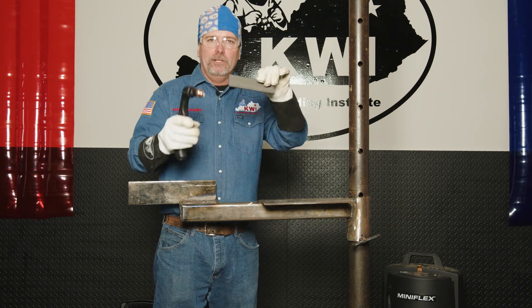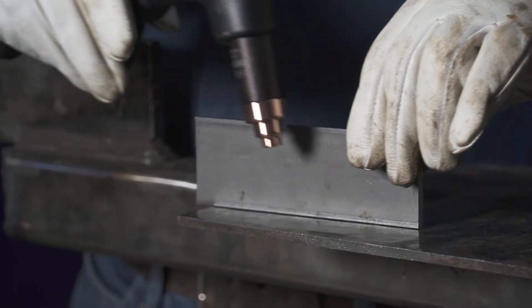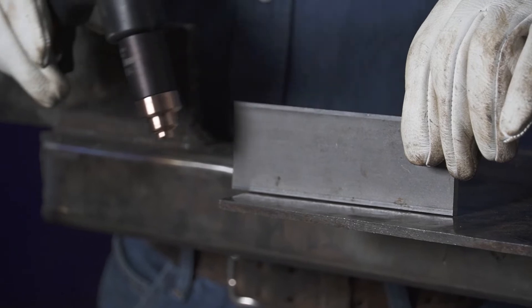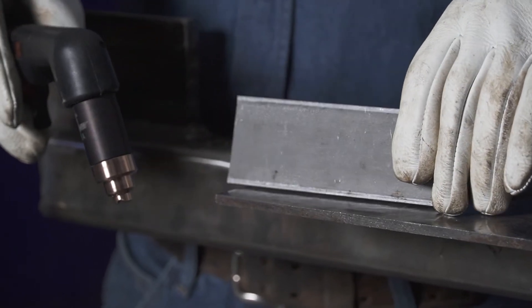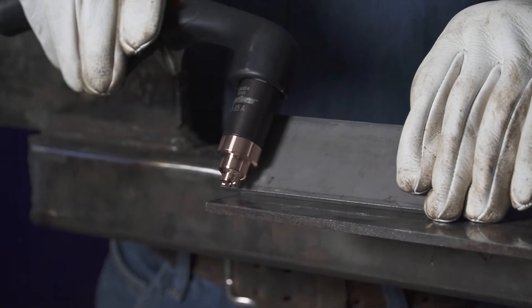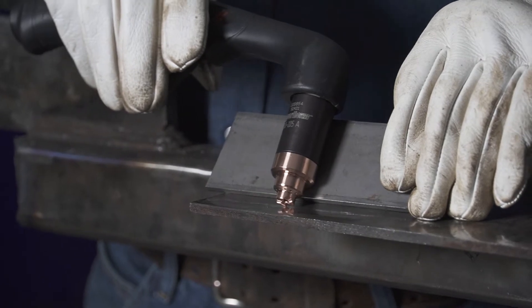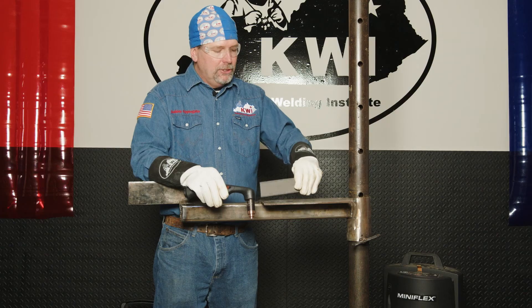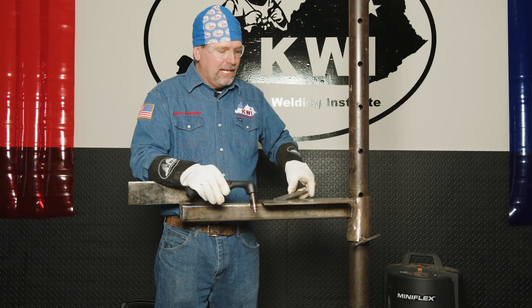You can be really fine with your cuts and do a really good quality job, especially if you were to use a straight edge and drag your drag shield right along to make that perfectly straight cut. Or if you were to angle your straight edge, then you can get whatever bevel that you would be required per the manufacturer or your employer. You can also freehand plasma cuts.